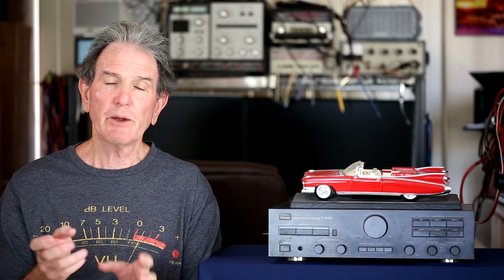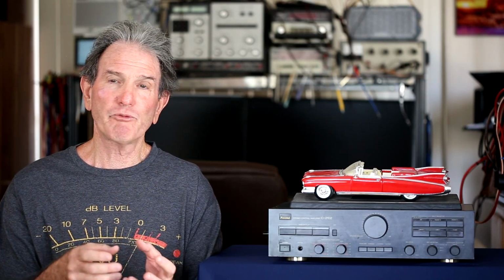There's a wire harness that is soldered to that control board, and it goes to another board. And I retouched the solder joints because it seemed sensitive, and it worked better, but it still has that kind of issue. So ultimately, I believe that pot, that Alps pot, is bad.